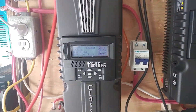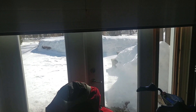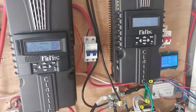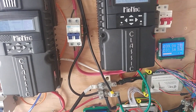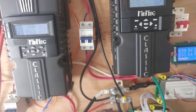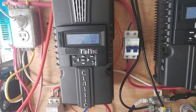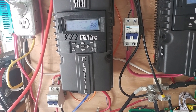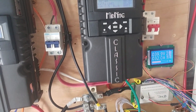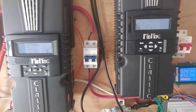Good morning YouTube — next winter day, still lots of snow here in Canada, but it's coming. I haven't been able to keep up with my one grid-tie going 24 hours a day with just the one array, so I decided to convert both of these to a 39-volt array. I've got 2400 watts on this one and 2215 on that one. With the two of them there, I can't charge my battery over 50 amps because my BMS shuts down at 50 amps.